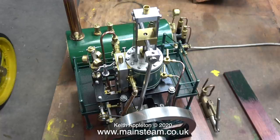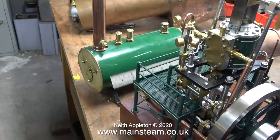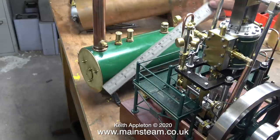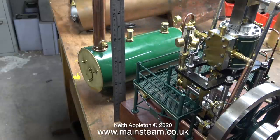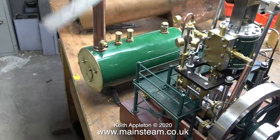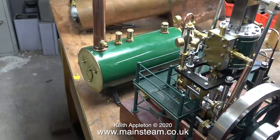Here is the basic proposed layout. Assuming the flywheel is the front part of the engine, the boiler is going to be behind it. To save space I'm going to make a special exhaust condenser — it's going to fit between the engine plinth and the boiler. To make this special condenser I'm going to use a piece of copper tube two and a half inches in diameter and approximately the same length as the boiler barrel. By making the condenser horizontal rather than vertical I can save space on the baseboard, and it will still have a good water capacity. It's going to be close to the boiler, but don't forget it's not really a proper condenser — it's an oil trap.